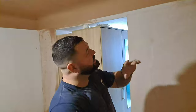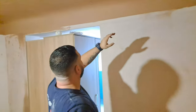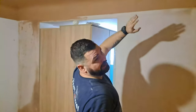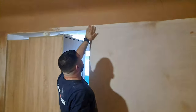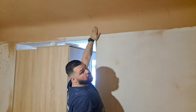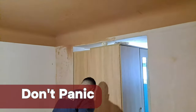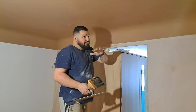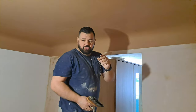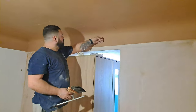Right, so if you remember in this section, we're re-skimming over what we'd already patched in at one point, because there was just a big steel beam in there when we patched it. So now, because we've just made a fresh plaster, it's sucked in, it's pulled in really tight. So now that's dried in faster than the rest of the sealant, because the paint acts like a sealant. So although we've coated SBR on everything, because we didn't give the SBR like 24 hours to completely cure, it still has a bit of suction through.